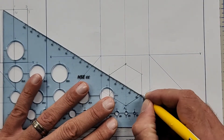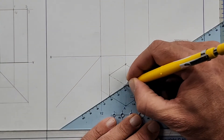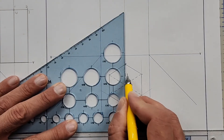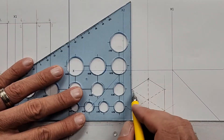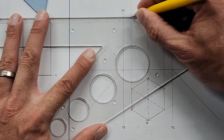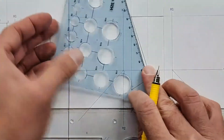They've given us hidden detail so let's draw that in. Fortunately for now we're just drawing what is given. This drawing shouldn't take you any longer than it's taking me — keep practicing; the more you draw the more confident and accurate you'll be. Once we have that part, we're going to project up. This is 60 so that's all the way to the top. I draw the top, already projected to the side, and the bottom is here.